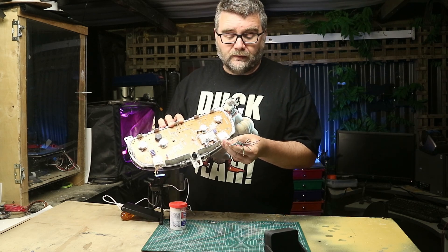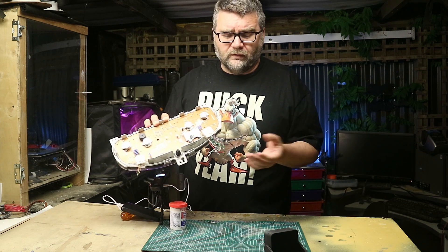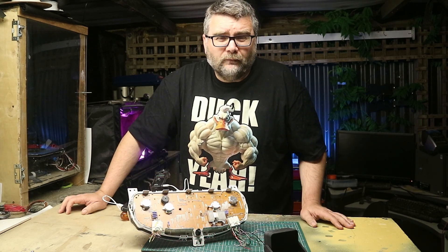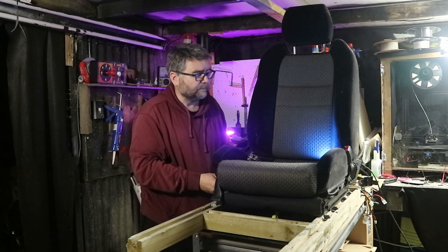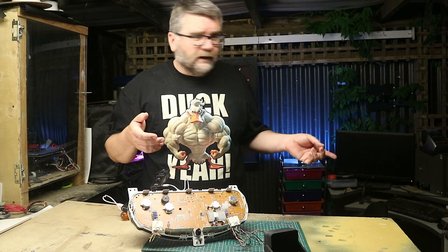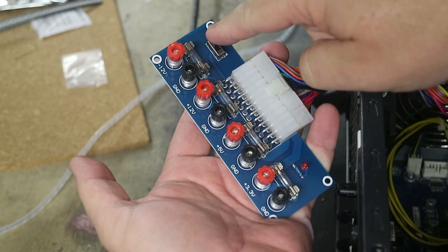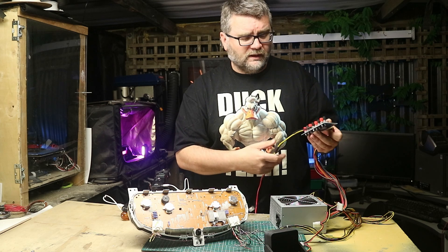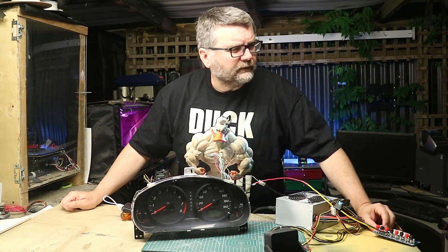I can almost guarantee that those wires aren't red and black as you would expect. There's a multitude of colors — red and white stripes, black or yellow stripes, all sorts. There's no standard for it. For this one it ended up being red and blue and black and white for the power. The power obviously needs 12 volts, so you can just get a wall power supply, or like I showed in a previous video, use a computer ATX power supply with a breakout board. You just plug your ATX computer power supply directly into it and it breaks out all the different voltages onto one board. So once I connect this up, we should start seeing lights come on.